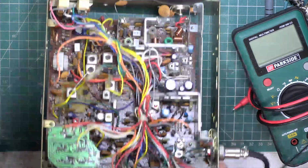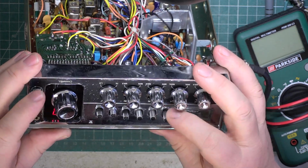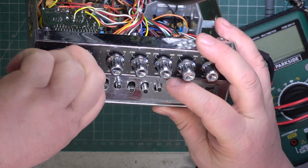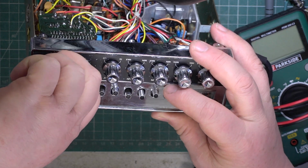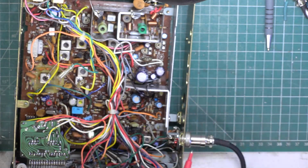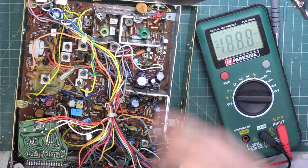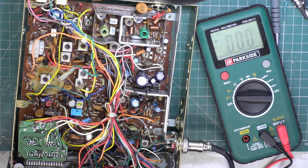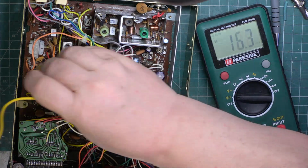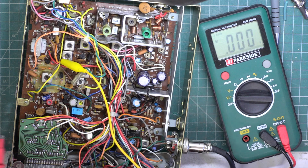I've had a change of plans. Before we do that, we'll switch it on and see. Let's go to channel 1 as if we're setting it up. I said channel 1, but I meant channel 40. We should be able to set the VCO for 4 volts. I'm not even plugging in the aerial. Not even bothered switching the test set on. So we use one of Alan's kindly donated leads for the earth.